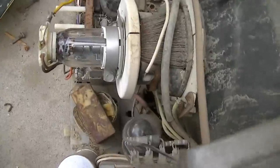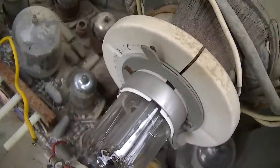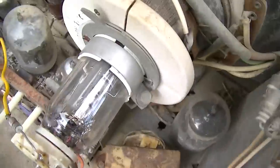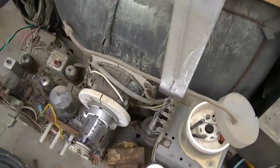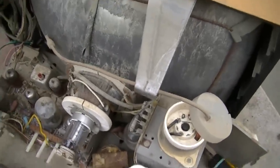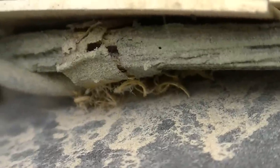Okay, it's developed some weird problem. I smell something burning too. I think something is arcing. Probably the copper has failed, the varnish has failed on the yoke, or maybe in the flyback. It's really hard to tell. Problems like that are super hard to diagnose because it only arcs out occasionally under high voltage. And it is the yoke. I saw it arc right down in there. And now it's stopped.